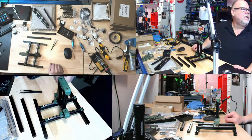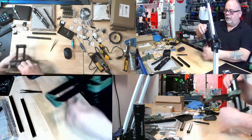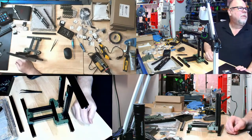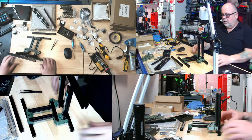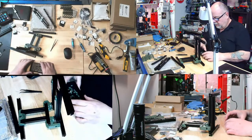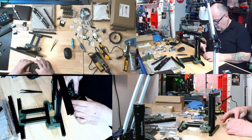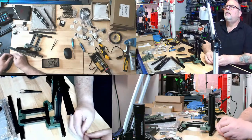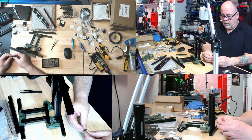Now, on the top rail, we're on the top and we're this way. Let's move you down. There we go. Look at that: preload 6 M3 nuts on the top and preload 1 M3 nut on the back. Going to 10:30 tonight, guys. 6 M3 nuts. I hope I have enough of these nut loaders. I think I do. They're only here to help square the upper and lower for the Z-axis to be. Ah, okay, makes sense.